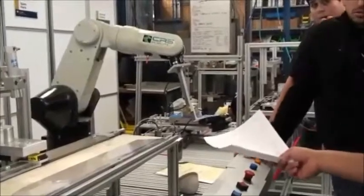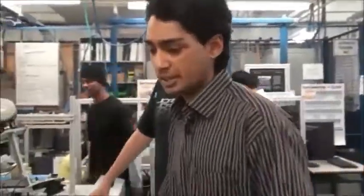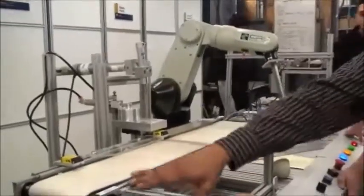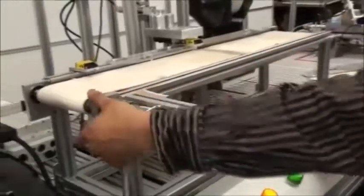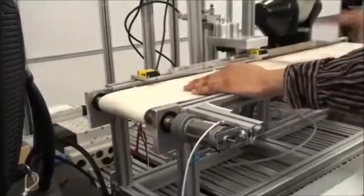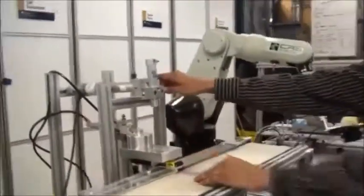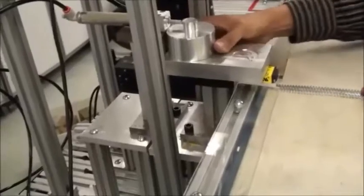The drilling station I'm programming right now, which I think is the most difficult part. I did major fabrication — we all had to start from scratch. I used extrusion rods to make the base for the conveyor belt and to make sure the motor is stable. I also had to make a shaft and bearings inside the shaft so the belt can run accordingly.